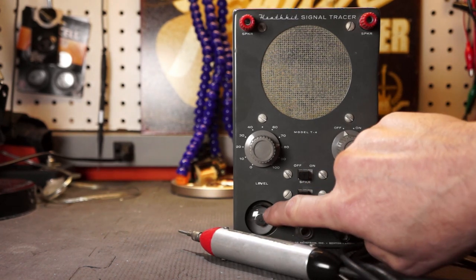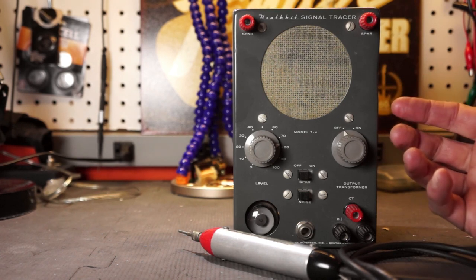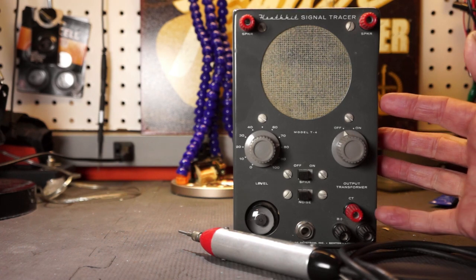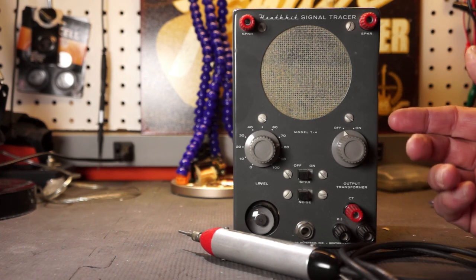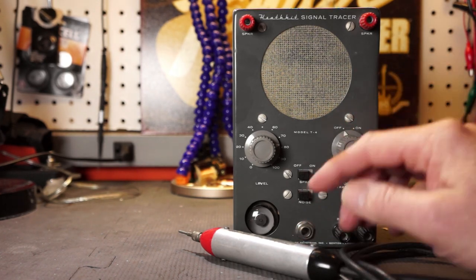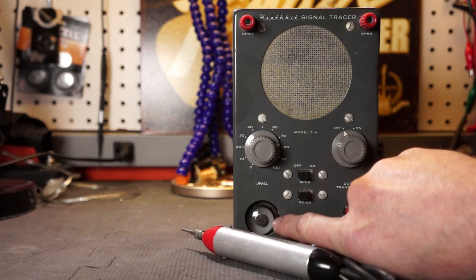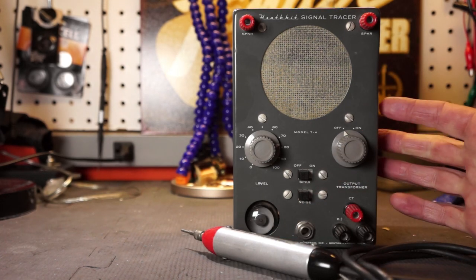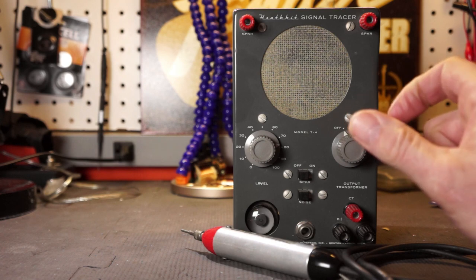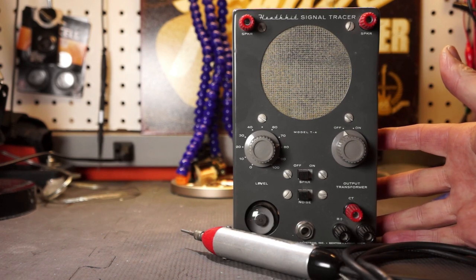The magic eye tube — this device is very much the same thing as an oscilloscope, just the audio version. You connect it up to some part of your signal path and visualize the signal on the oscilloscope screen. But with a signal tracer, what you're doing is listening to that signal. This provides a little bit of a crude way to visualize it too, on this magic eye tube. Essentially what a magic eye tube is, it's basically a cathode ray tube responding to a signal going through here, with a little light that opens and closes so you can get some idea of whether you've got signal or not.